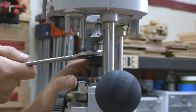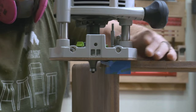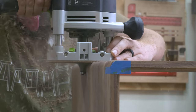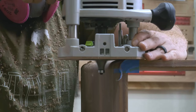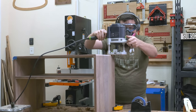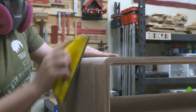Now it's time for those massive round-overs. I'll turn on my router with a large round-over bit — doing this really emphasizes that wrap-around grain pattern. Some may think this is kind of risky structurally, but there's enough material there to support the case and the design's worth it. With the right side of the case done I could do the same to the left, then feathered out the curves with some 220 grit sandpaper.